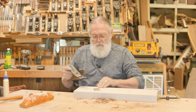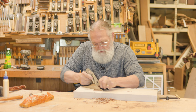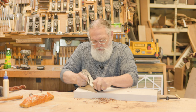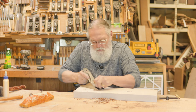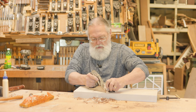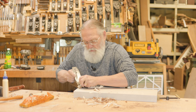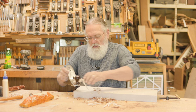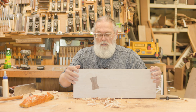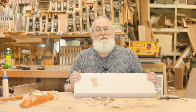Almost where we want to be. You could sand this off or take a rasp to it, but I just like to use the hand plane to get it done — it cleans it up real nice. And there we have it: a beautiful bow tie, nice and flush to the face of our piece, covering the crack. If you use a good contrasting wood, it gives an aesthetic appeal and makes it look really cool. Go ahead and comment down below, subscribe if you can, and if you've got any questions put them down there and we'll do our best to answer them. Thanks for stopping by.